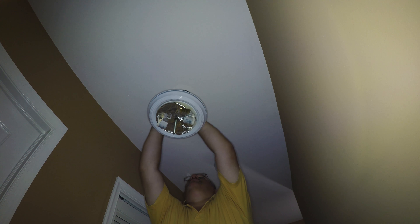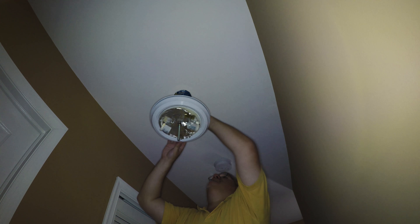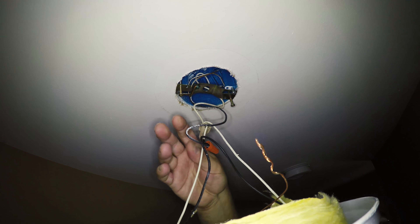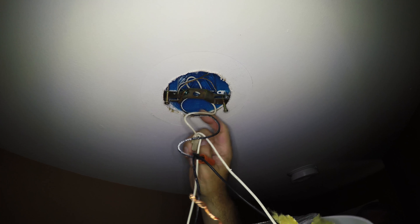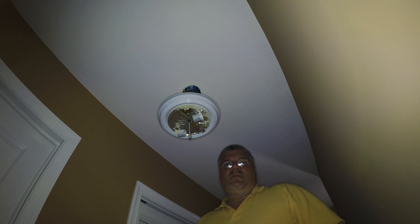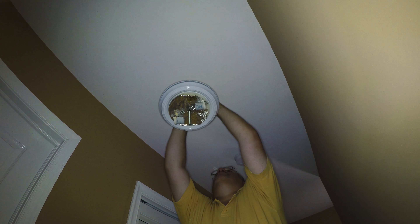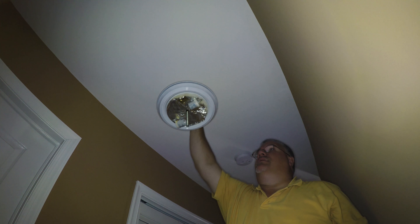We have the hot connected and now we're connected to the neutral. We have the black connected with this wire nut - you put the wires together and tighten them. I could use a wire nut if I found one, but I'll try to connect it to that screw. The lamp that was here was a single lamp with an LED bulb, 10 watts for 60-watt equivalent. If a ground wire is supplied with the light fixture, it's really important that you connect it.